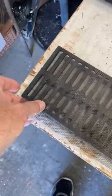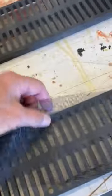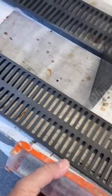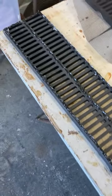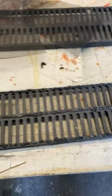I have all the screens cut just a little bit bigger than the grate. You can see I've got all five of them here. Now what I'm going to do is run a bead of this Power Grip around the outside edge and down the middle, then lay the screen into it and let it dry. Maybe put one more coat of adhesive on top. I've got a bead of adhesive around the edges and down the middle — now I'm going to lay the screen in and use my finger to rub it out.